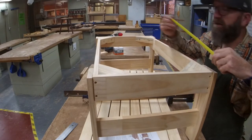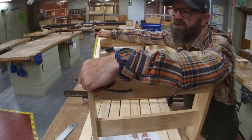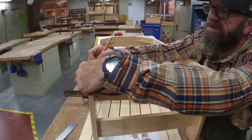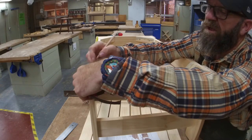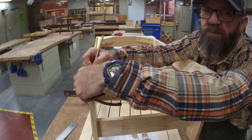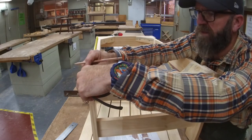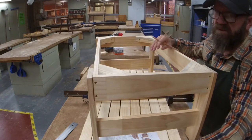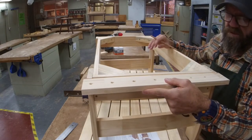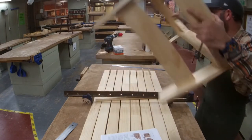I need you to check, because I've been caught out in the past, that from the very outside edge to outside edge, this one is exactly 842. Give yourself a centimetre, so add 5 mil to the 420. It doesn't make a massive difference if it's a smidge wider, so the rail sits a smidge on the outside. I would prefer that than having it the other way around.